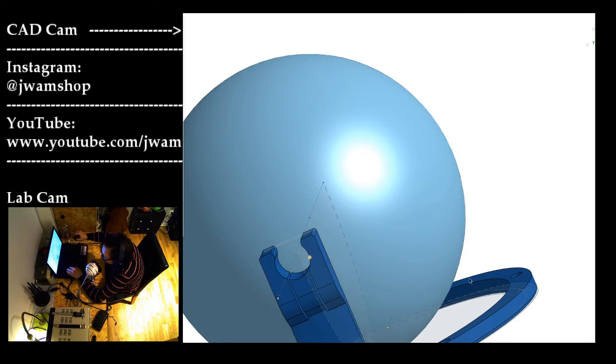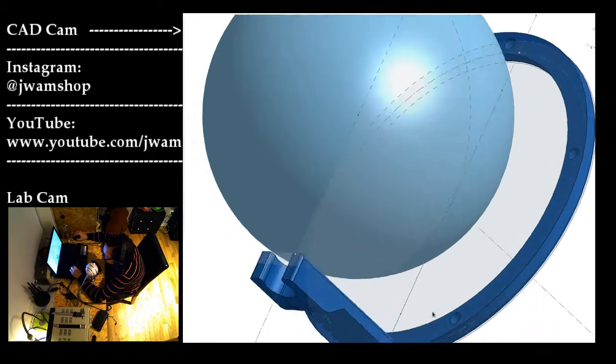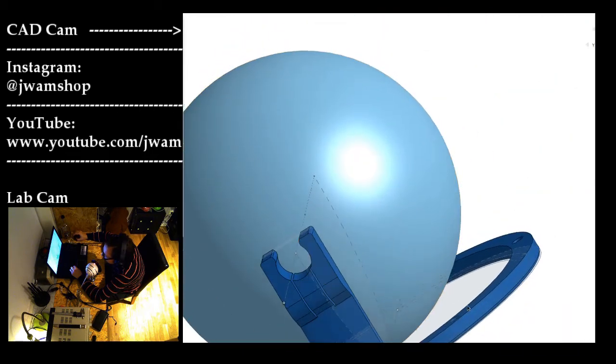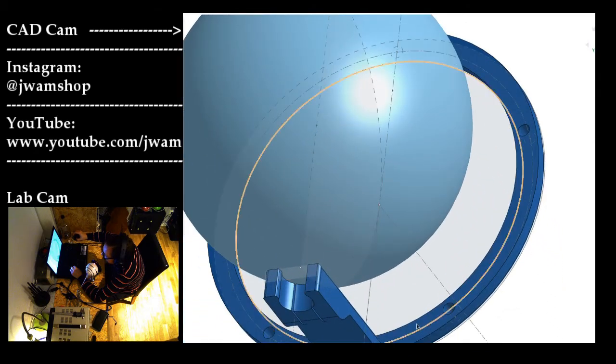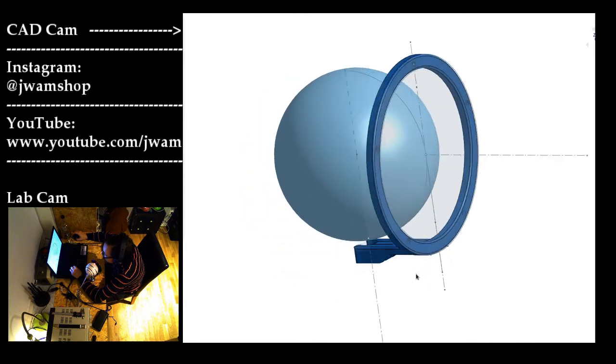The easiest way to do this in CAD is to use something called a Boolean operation, which takes a tool that can be used to reduce or add to existing objects. So in this case, I have this big blob into which I want to make this hole. So I simply use the Boolean operation to reduce the parts that is the shaft from this, and then create a sketch to make some slits into this around some corners, and that's that.